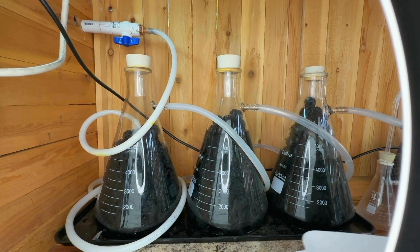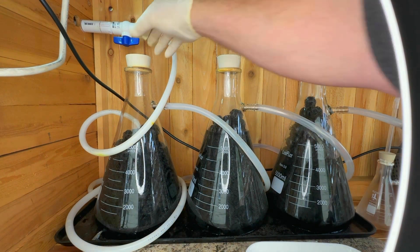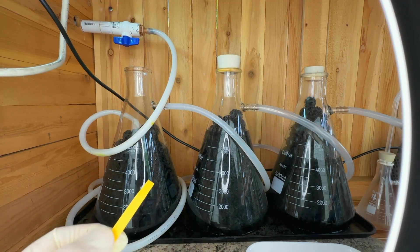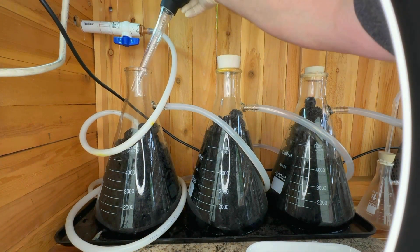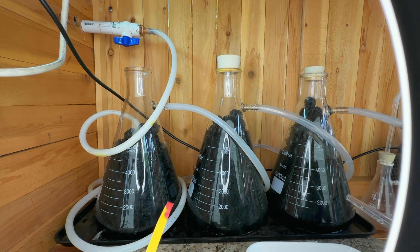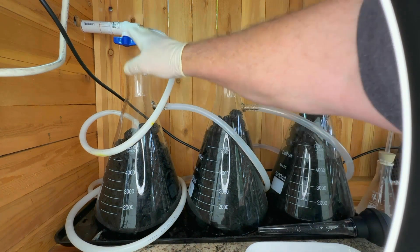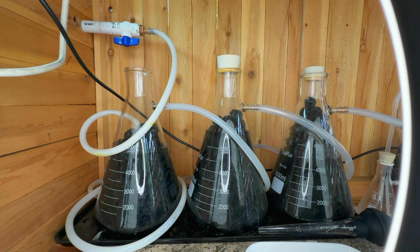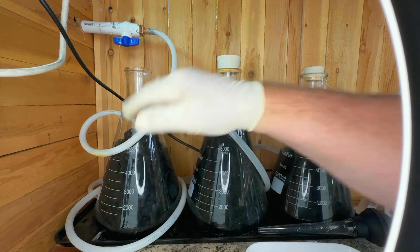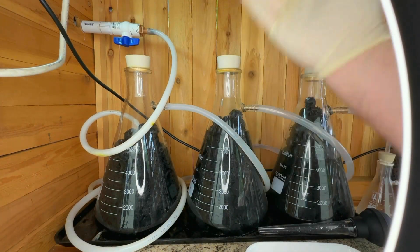For our daily maintenance, it's really a matter of checking our fluids to ensure the pH is correct, and then doing any replacement of fluids to bring the pH into line and ensure we have enough buffer to capture the nitric oxide gases produced. This first beaker contains a dilute hydrogen peroxide solution. This makes nitric acid, and you can see we are relatively acidic — it does scrub a fair amount of gases and gives us an opportunity to recapture some nitric acid for further use. Generally when I see it this acidic, I'll go ahead and replace the solution.